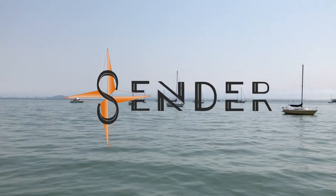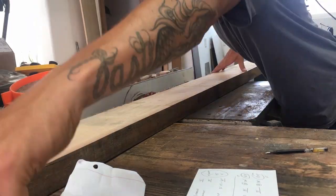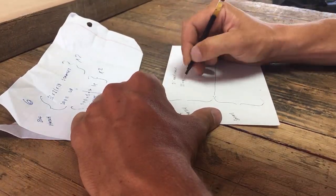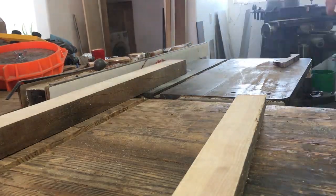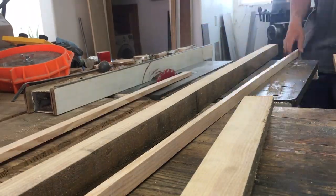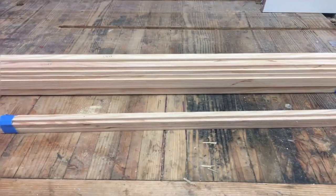Meanwhile, up in the mountains, I was at our friend's shop to mill up some Douglas fir for our hatch frames. We got more lumber than we'll need for these hatches, so here I'm just coming up with a cut sheet to make the best use of the material. A few of these pieces will be mounted to ribs with a slight angle, so here I'm adjusting the table saw blade to account for that. Here's all our stock for our hatch frames — dry, straight, square, ready to be installed.